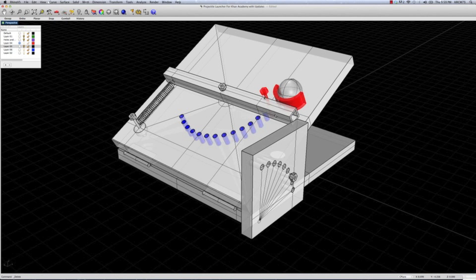What we wanted to see if we could do is remove the pin and the cradle. One reason is that the pin can potentially be a pinch point. It also builds up stress at a very specific point on the aluminum bar, and that stress can work-harden the aluminum — it actually changes the crystalline structure of the metal over time, making it more brittle and eventually causing it to crack.